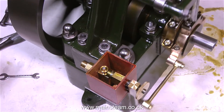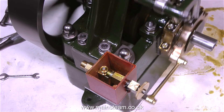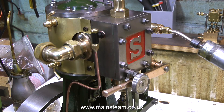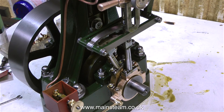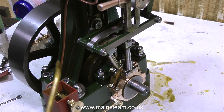In this clip you can clearly see how the lubricator works. The arm connects to a reciprocating arm which is on a one-way clutch, and then there's a crank pin which lifts the plunger up and down and pumps the oil from the tank up to here. This is a check valve or clack valve, and this is how the oil is fed into the steam chest and subsequently to the cylinder. Whenever you do any piping that's carrying oil, always test it. When using very thin piping like this, it's quite easy to put too much silver solder on and block up the pipe at one or both ends. I've done this on many an occasion.